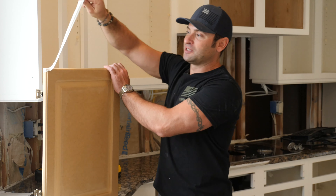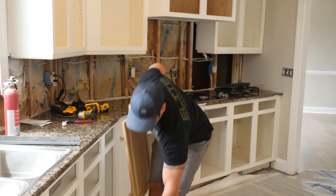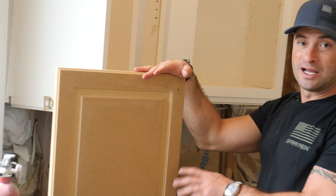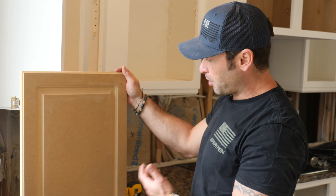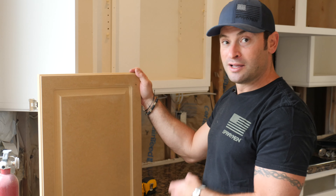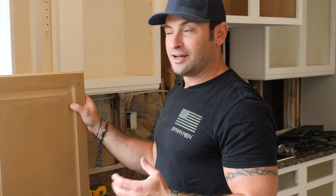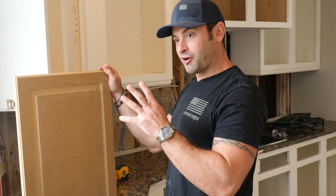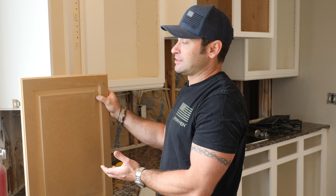I definitely don't want to deliver a rippable cabinet. Realistically, you could take this back to the thermofoil factory and just get a new finish on there. If you have thermofoil doors, you can rip the stuff off and you'll have a perfectly machined door as it came out of the factory day one. The problem is once you get this thing wet, it's almost like a phone book — two days of rain and it's going to look like a frayed up mess. It's just going to fall apart.